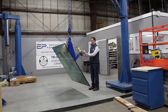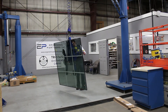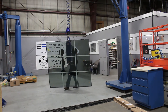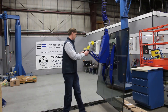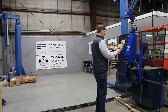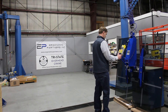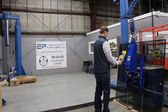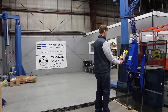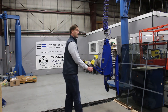I'm going to pitch this back up — you heard a little air pulse there. You can bring it back to the vacuum level. We're going to set this back down very slowly. You'll hear the gripper safety circuit kick off and help take the weight off the part. That is your tool.